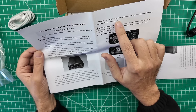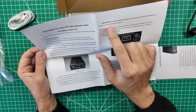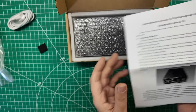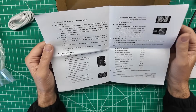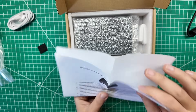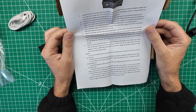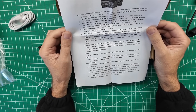Start tuning power: the device defaults to manual operation mode. The threshold of start tuning power is 3 watts, and the screen is always on. So that's one of the things I was worried about — can you use this with QRP radios? The older versions: ATU-10, ATU-40, or ATU-100. If you got the ATU-100, you couldn't use it with a QRP radio, so you had to get both. Now you can just get this one, and it'll work with both.